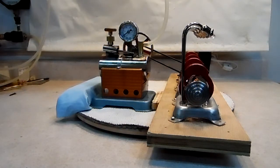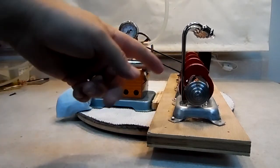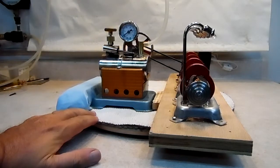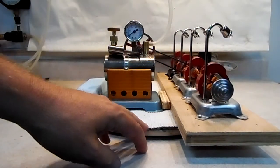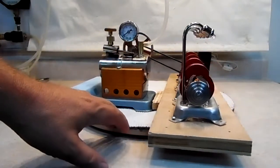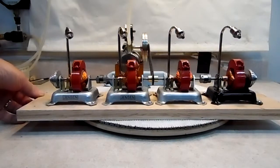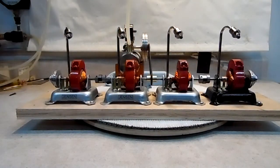Hi folks, here's a fun little video I put together — you probably won't see it anywhere else repeated. It's a Jensen 85 that I've converted over to ball bearings on the axles, and I've got Jensen No. 15 generators — four of them. This little Jensen 85, the smallest of the Jensen line, is going to power four ball bearing raced generators. They're all hooked with the Lovejoy connections, and I made a special brass drive pulley.